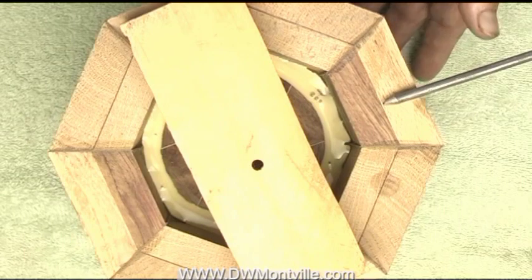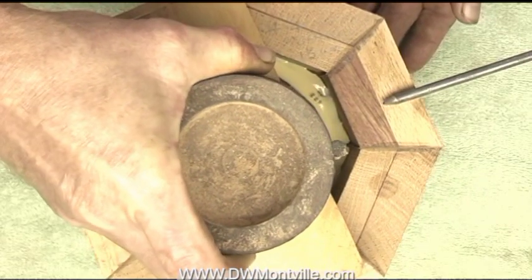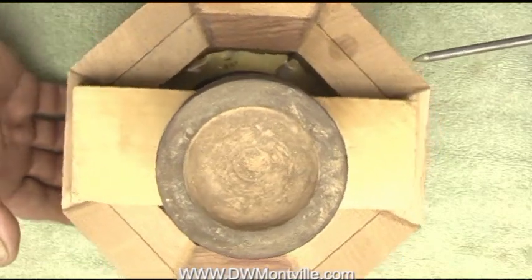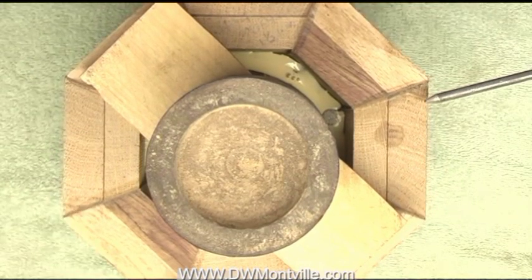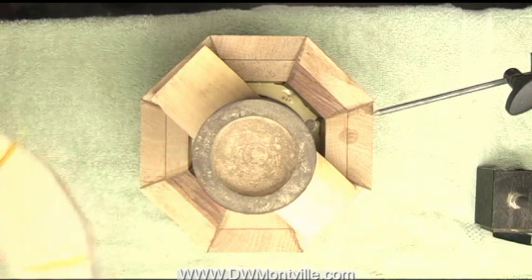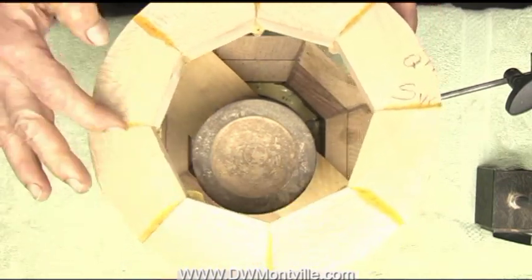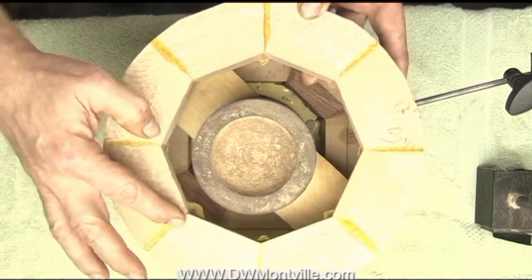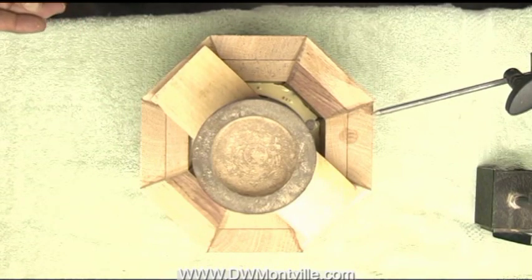Now what I've got is a little block of wood and a small weight. You don't want to use a clamp on this. I can check, but the block of wood is going to interfere with me, so I'm really going to go on faith that I haven't moved it, and that's where it's going to rest. That's the glue-up method. I'll use the same method on the top ring. This one will be centered fairly close, but since there are no split line details, the level of accuracy in centering isn't as high, and all the discontinuities will be turned round on the lathe. So I'll probably put that on next, and then we'll go to the lathe and start making this bowl.